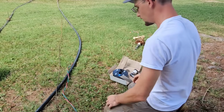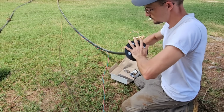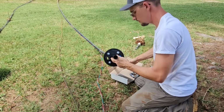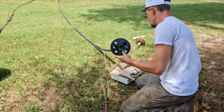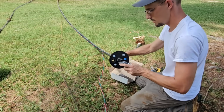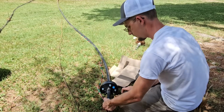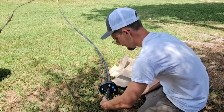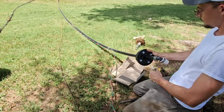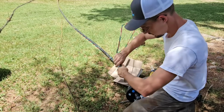All right, let's go ahead and put this well seal together. Got everything we need here. First thing we're gonna do is slip our well seal on. Tight fit. Okay. Both clamps. Little heat. Barb fitting. Tighten our clamps up. Woo, that's hot. Pull our well seal back up. Spin it to where it lines up with the wire. Take our wire and fish it through the hole.